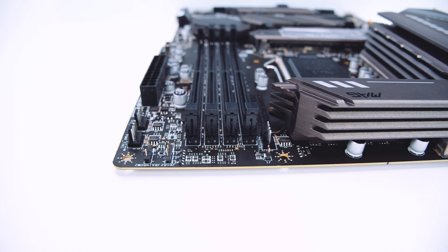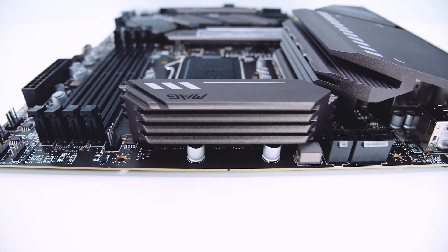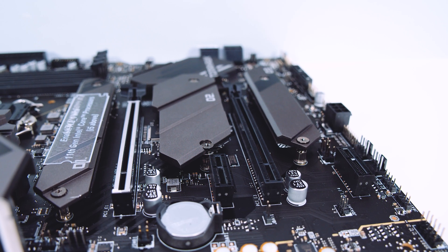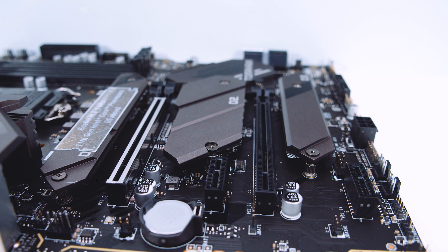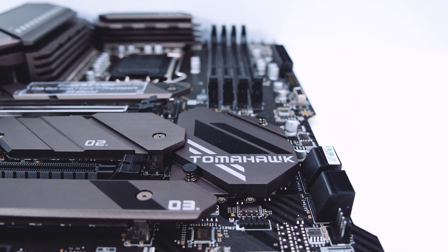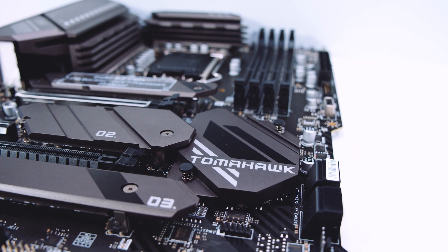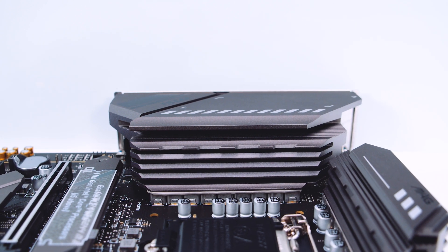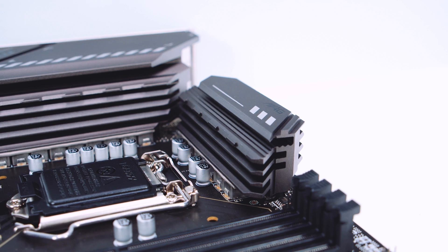Across the top of the board there's another 3-pin 5-volt addressable RGB header, another 12-volt analog RGB header, a big chunky VRM heatsink, an additional PWM fan connector, a 4-pin EPS power connector and an additional 8-pin EPS power connector. For PCIe slots: the top slot is a x16 Gen 4, then a Gen 3 x1 slot, a Gen 3 x4 slot, and another x1 slot towards the bottom. The board features Intel's Z590 chipset supporting 11th gen Rocket Lake and 10th gen CPUs. The VRM is a 14+2+1 digital setup with 60-amp power stages, and the IO cover is essentially a giant connected heatsink.